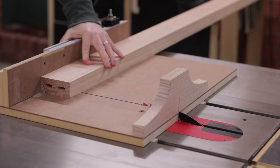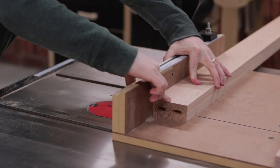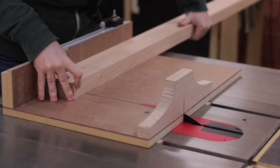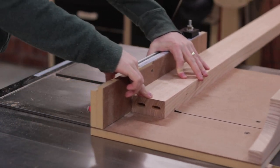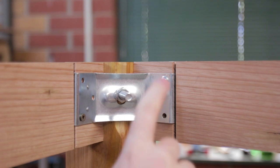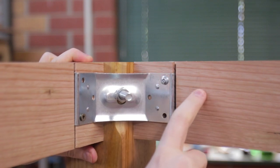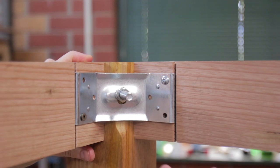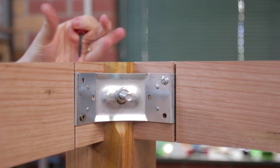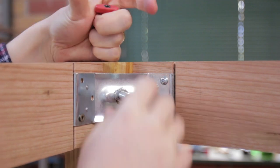Those kerfs can be cut on the table saw using a crosscut sled or a mitre gauge. I used my new mini crosscut sled, so handling the 1.8-meter aprons was a little tricky but it went pretty alright. The brackets I have measure 1.7mm thick on the steel, so a standard kerf blade or even a thin-kerf blade would work just fine. These brackets are meant to be screwed into the aprons, which means you don't actually need the dominoes for alignment once everything is set — you just slot the leg in from the side and screw it in.